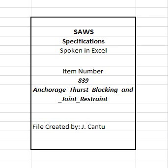16. Valves 12 inches or larger in size shall be supported on a concrete pad extending vertically from 12 inches below the bottom of the valve to the lower quarter point of the hub and laterally from face to face of hubs and transversely from wall to wall of the trench. 17. All joints for carrier pipe installed within casing shall be restrained.